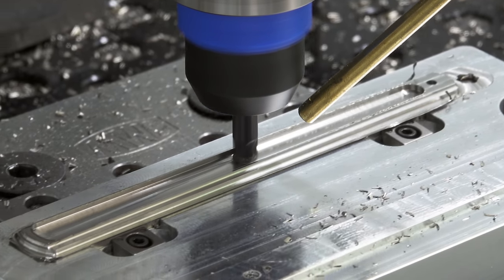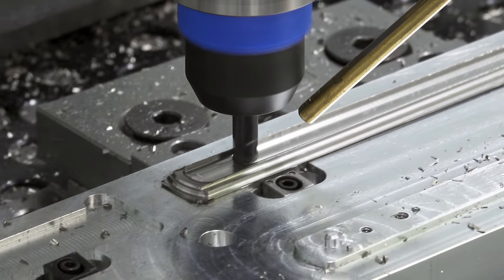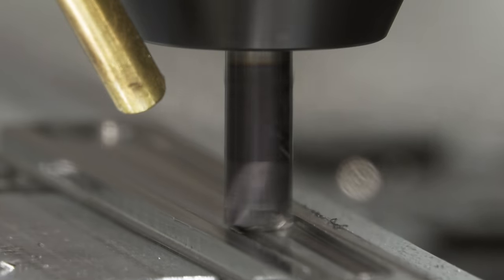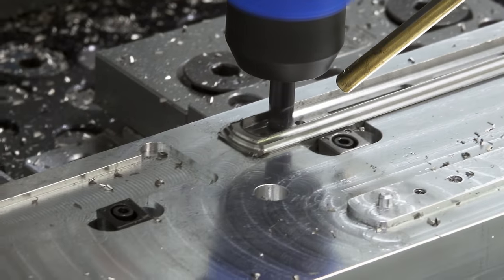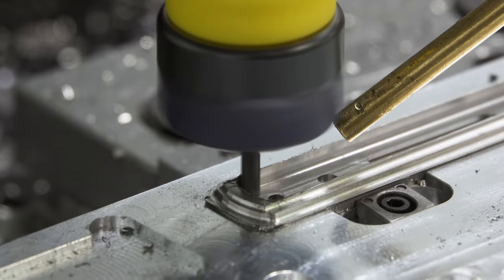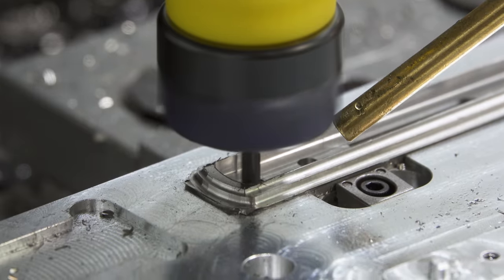The feed mill is meant to take fast, shallow cuts; it has short rounded flutes that direct the cutting forces in the more rigid vertical direction. Hopefully this tool will work better in titanium than regular end mills did. I clean up the floors and the walls with an eighth-inch end mill.